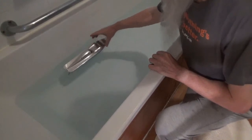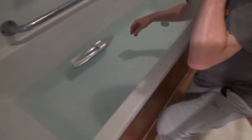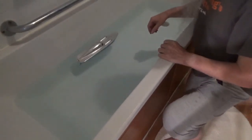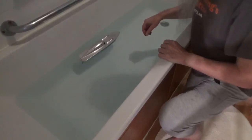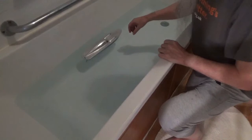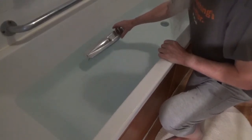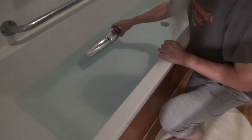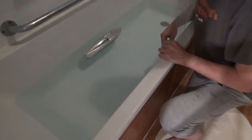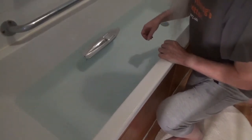The next problem was finding a battery that would fit. I don't know what was supposed to go in there. Somebody before had botched it to fit a C-sized battery, but that's only one and a half volts and it wasn't enough. It's supposed to run on three, I'm pretty sure. So because it had already been botched, I had no qualms about botching it again to fit another three-volt battery, which I did have.